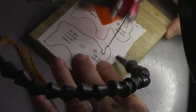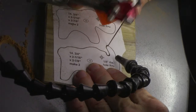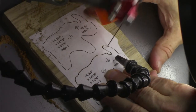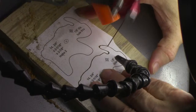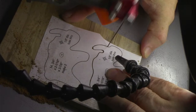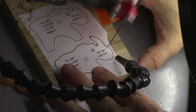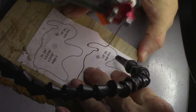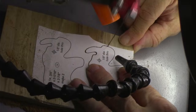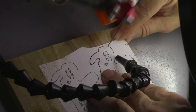Yeah, see, that's jumping. That's the one thing I don't like. You can see how that nibble is way big, and I do not like that. That's a mix of the thickness of the blade, type of blade. And I think this is the modified. So it has a couple teeth that are pointing up instead of pointing down, which helps clean out your cut. Modified geometry.